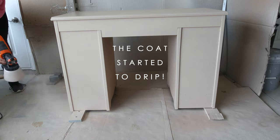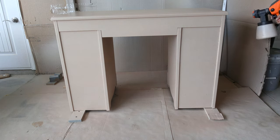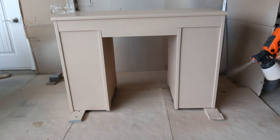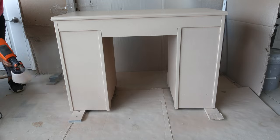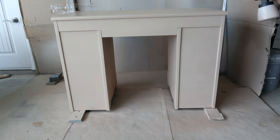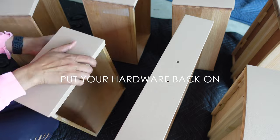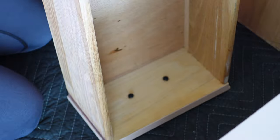So I decided to whip out my roller and just roll the rest of the top coat onto my desk. I realize using a roller is a little bit unconventional when it comes to top coat because of the bubbles it can cause, but I like to focus on one area at a time. I make sure the top coat is covering that entire area and then I continue to roll over it until it's a little bit tacky and all of my bubbles are gone.